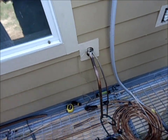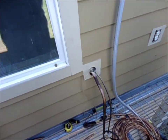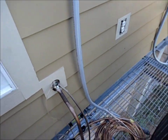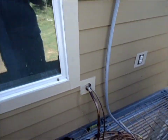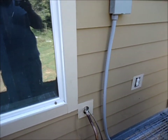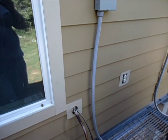The beauties of new construction — I put 200-something pounds of pressure on this system when we did the rough-in, came here today with no pressure. Right inside there I got a leak; the carpenters drilled or ran a nail right through my suction line. So now I got to cut this wall open on this brand new house. That's the beauties of new construction.